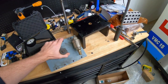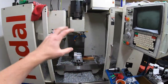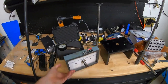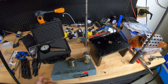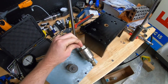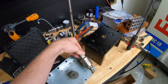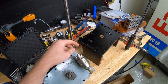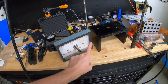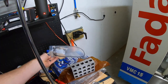I also noticed it seemed to struggle a little bit when actuating the tool change using the tool in/out button — that's more of a touchy-feely explanation but something I observed. I also noticed there's a leak around this fitting back here. There's a nylon washer and I think it's a compression fitting, so you're not supposed to use thread tape, but that's what I had on hand and I wrapped it a few times and it stopped leaking. I also noticed a small leak in one of the corners with the O-ring, which I've bought a replacement for.